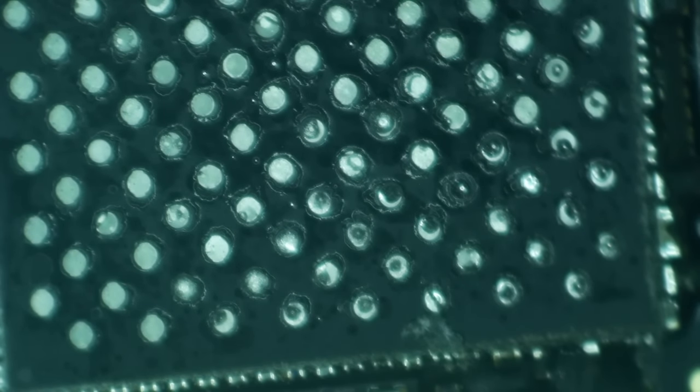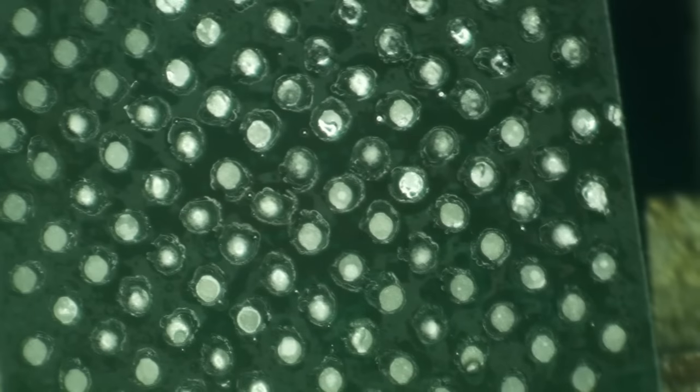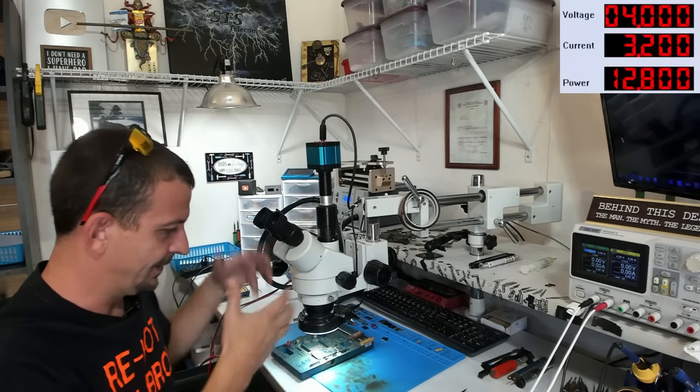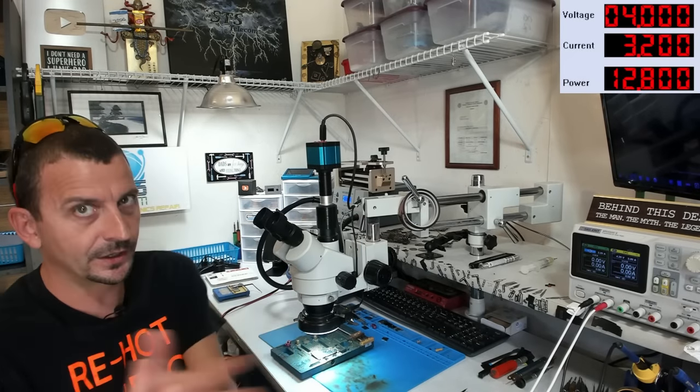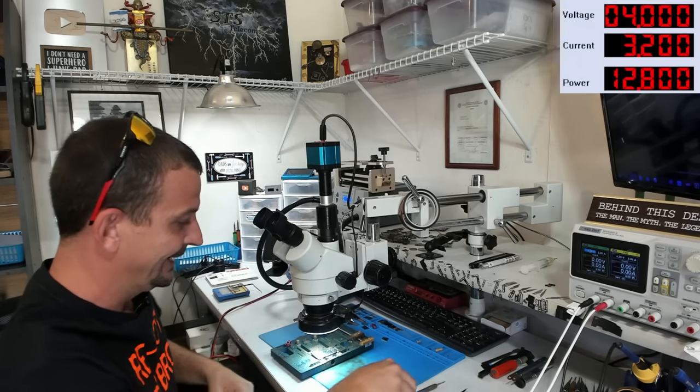Okay, blade's going in. Oops, NAND is coming up. Ching, pops right off there. Nice and pretty. And again, I'm letting my NAND cool in the ambientness of this board instead of pulling it away and letting it have the air-conditioned air from behind me hitting it.